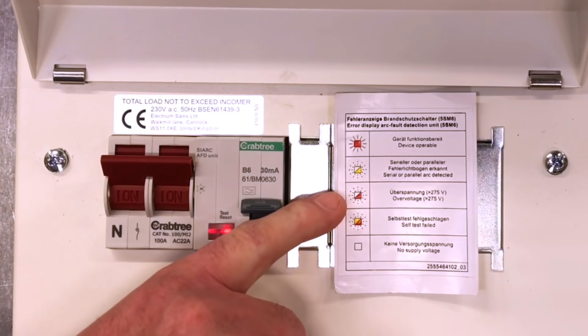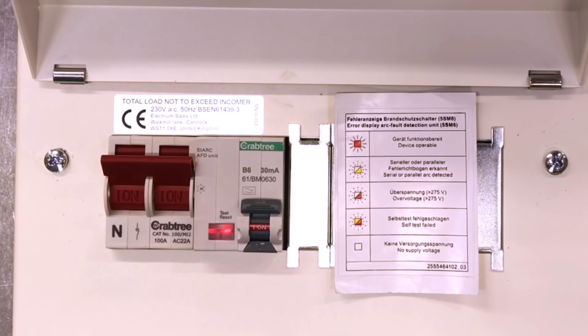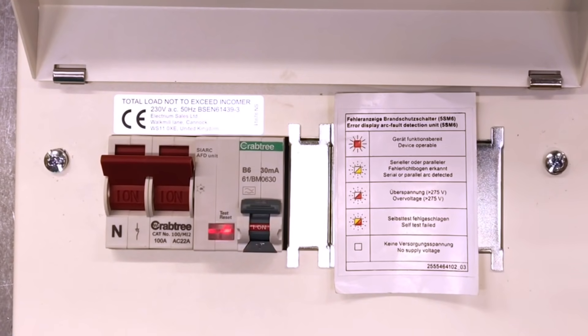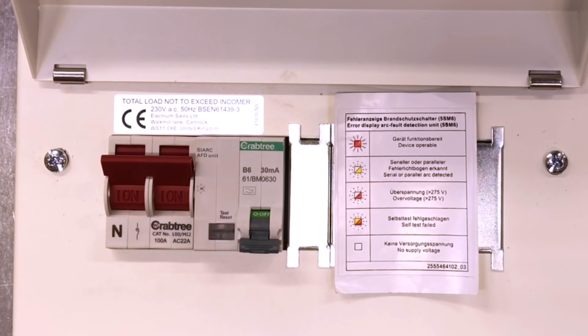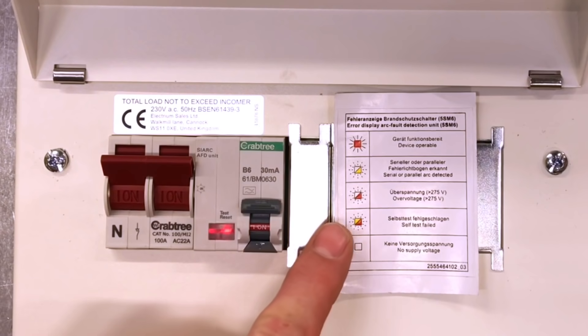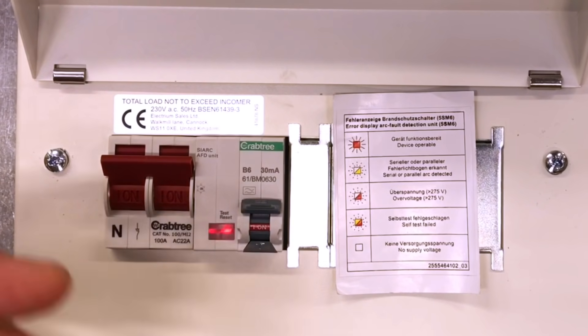The next indicator: a flashing red light — where half the window is clear and half red — indicates an over-voltage fault, meaning the voltage has become too high and the circuit has been disconnected. Then there's a self-test: by pressing the button on the AFDD window the miniature RCBO trips off and de-energizes the circuit. Re-energizing returns the solid red light. A self-test problem would be indicated by a flashing light with half the window yellow and half red.